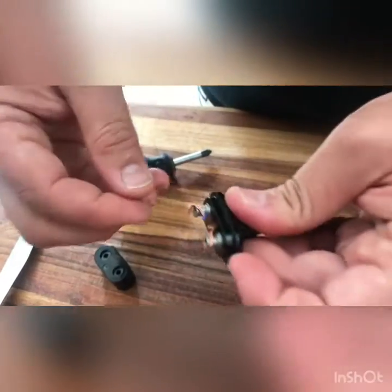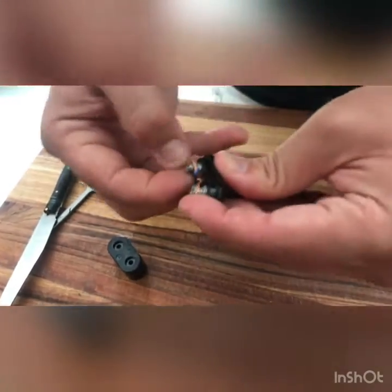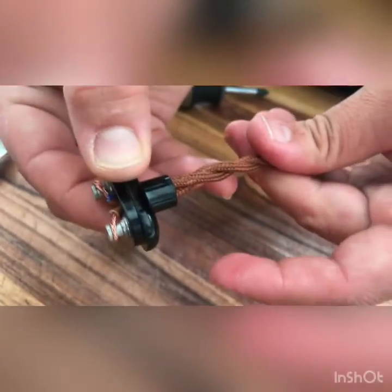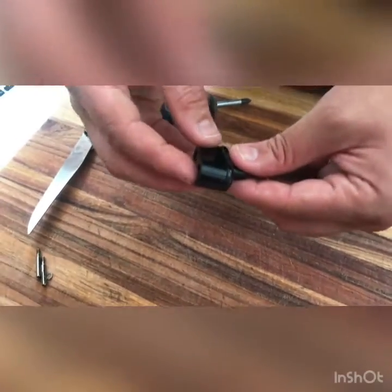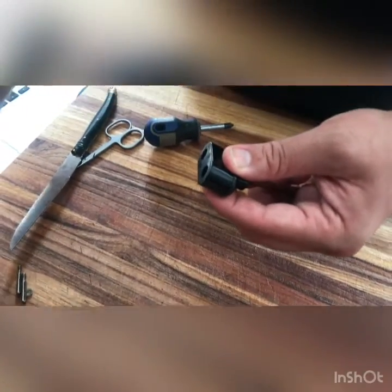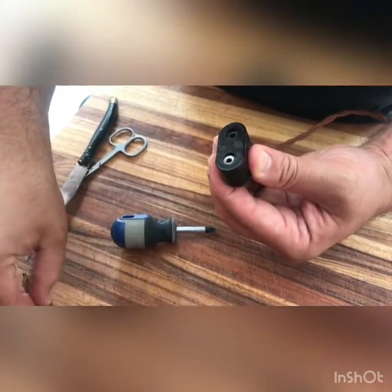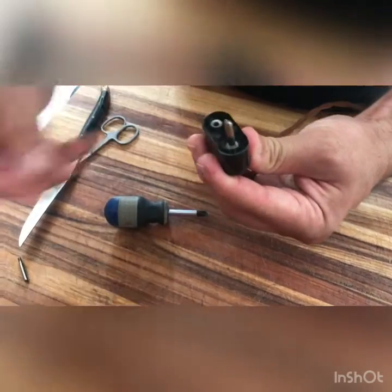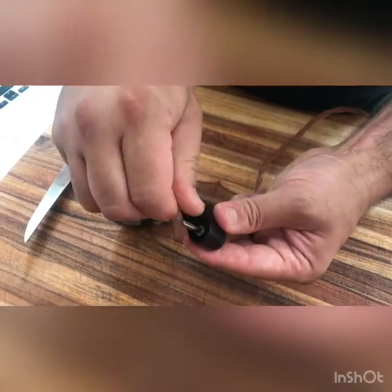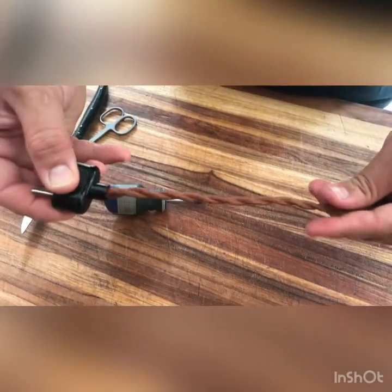So now make sure that there's no sort of cable or fiber from the cord that's making contact in there. Just make sure it's just the wires and the screw, but that should be pretty straightforward. Just give it a little tug, make sure the screws are tight. Everything is okay. Then you take your cap, put your cap back on the top. Then you should have your 2 screws, very similar to what I have. You get your screwdriver, and then those last 2 screws should just go in. All that's nice and tight. Give it a little tug, everything's okay.